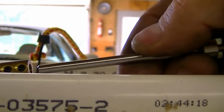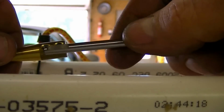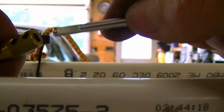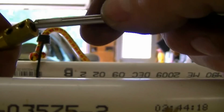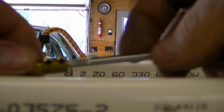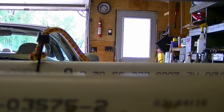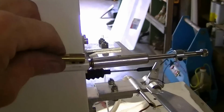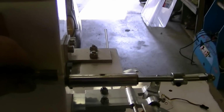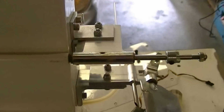the prop shaft. You get the prop shaft here, right? And you get the flat spot in the drive, and you put this in there. Oh man, Bill, what'd you do? Give me the wrong one? May have. But anyway, you put that in there, right? Or you ream that out a little bit or whatever. You get that to fit in there. And then when you're putting it together, you put it together all up here. So what happens is that propeller shaft gets locked in on the strut, so you don't lose it if the motor collet comes loose. It's just a good system from Octura.